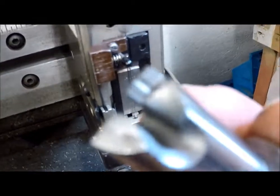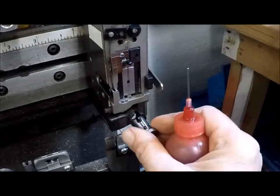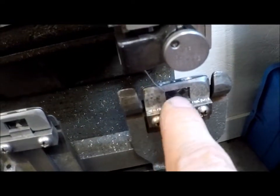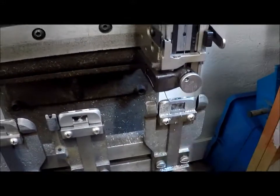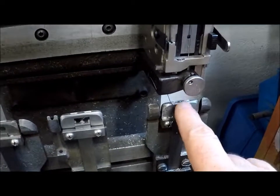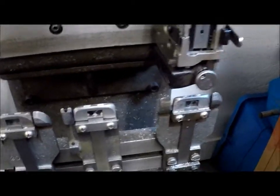Occasionally, the ramp on here — right here — put a little lubricant on there. If you put too much lubricant on the head, it'll make your job dirty — the oil will come out and get all over your books, and then you'll have problems. Do not lubricate your clincher points — run them bone dry. This clincher point, the two little points in there, and the slide — whatever style you have on your head — run those bone dry. Clean them off. These little paper dots that build up here can just flake off — they'll just fall off, and this won't jam up. If you put oil on there, it'll work for maybe just a few minutes, but then those little paper dots jam up and cause all this stuff to gum up and get messed up.